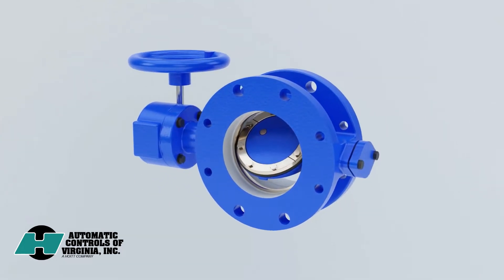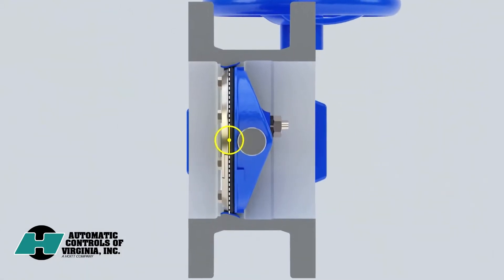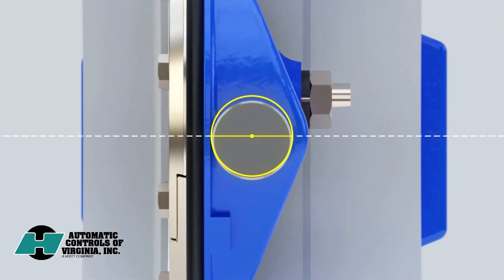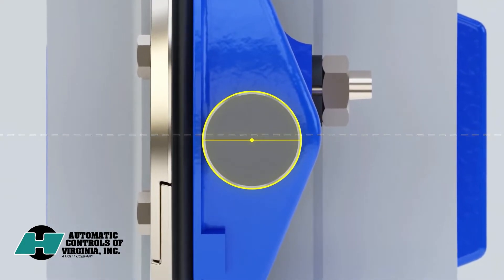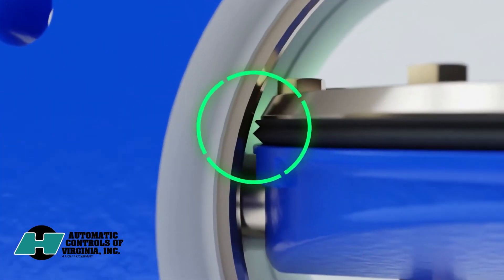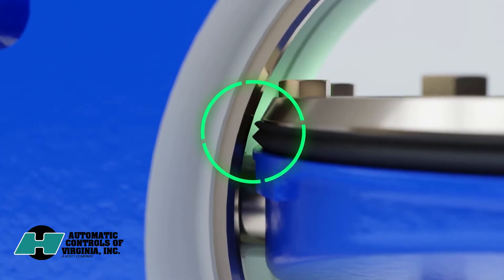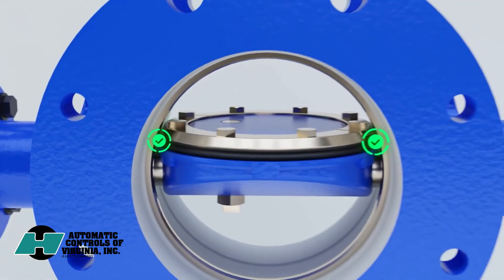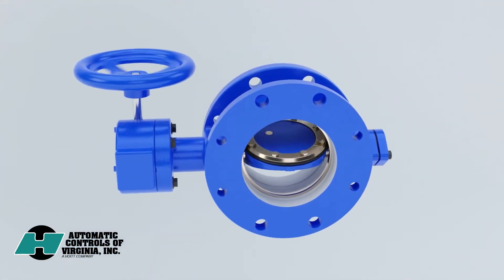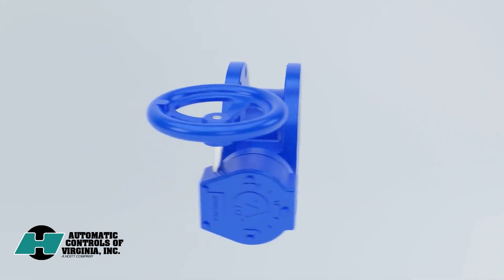Here's how it works. In addition to the offset from the body, the centerline of the valve shaft has a slight second offset from the pipe centerline. This allows the resilient rubber seat to completely lift off the metal mating surface when the valve is fully opened, eliminating rubber seat compression and two potential leakage points. Add a precision nickel-welded seat, and you have the peace of mind of a valve that seals reliably every time.